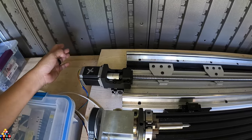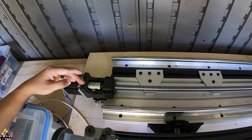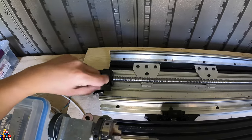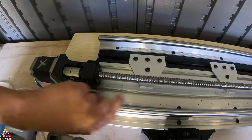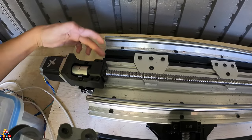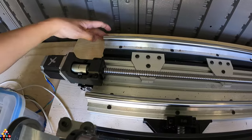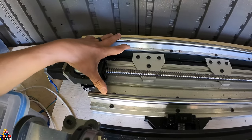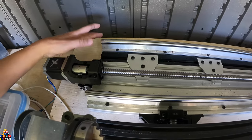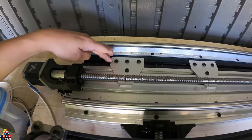On a lathe the Y-axis would be this way and the X-axis would be this way — it's just more confusing. So I made this my X-axis. This is on the 30-series aluminum extrusion. I had to maximize the extrusion, extend it so that all the rails are true and as straight as possible. Everything is all independent — nothing is dependent on the wood anymore.